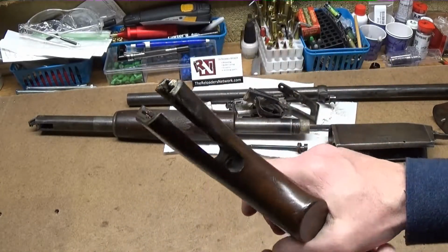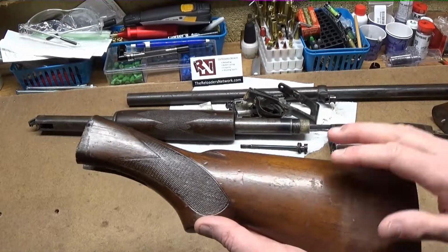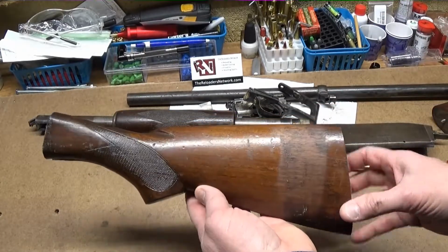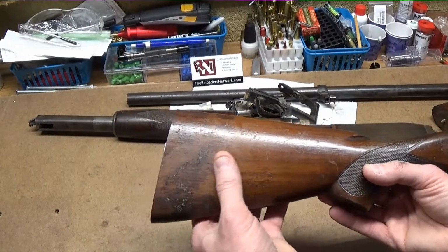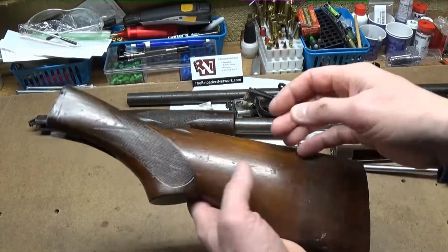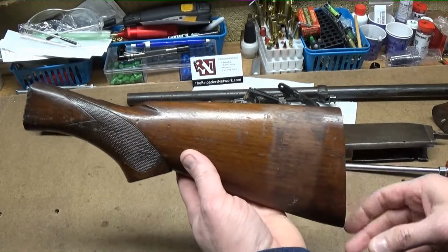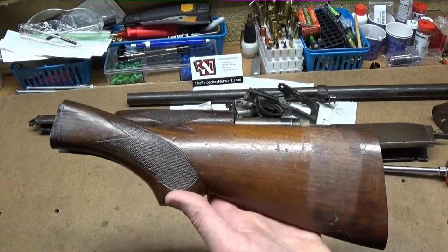So I'm going to actually show you guys how I clean and prep this if I'm not going to refinish it. So the first thing I'm going to do on video is get some lemon oil and a rag, and rub this down and show you what it looks like as it gets cleaned off. And believe it or not, the lemon oil alone will clean it up real good and make it look a lot nicer. This is as original right now, as the way I received it. It's kind of dirty, it's got grease and nastiness on it. And I'm going to do that on camera. I'm not going to do any other cleaning, no mineral spirits, no other prep of the wood at first. This first wood processing video, I'm going to just use lemon oil so we can see what it looks like.